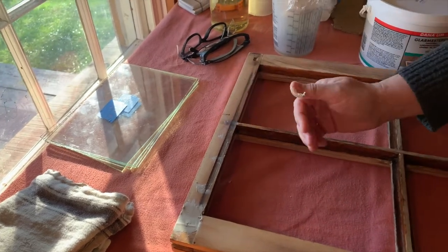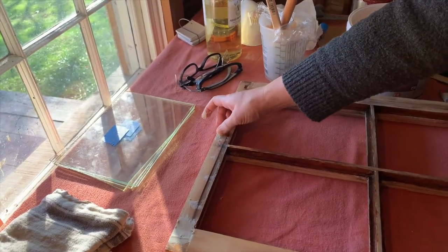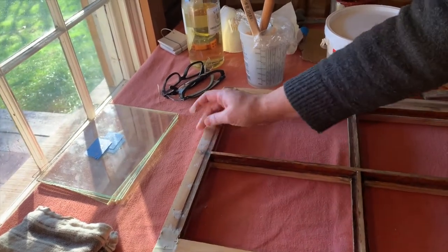It's not like you can sand it right away. You can wait and sand it, but it takes a really long time. This putty doesn't dry very quickly — if you leave it to dry, you're going to be waiting weeks and weeks. Last summer, the old putty took three solid weeks to dry. We hung the windows and there are actually a couple of my little mitt prints on the putty of some of these windows because it didn't dry in the 10 to 14 days we had them at her dad's garage.